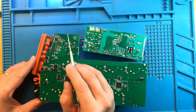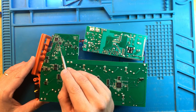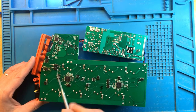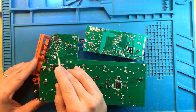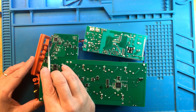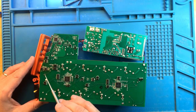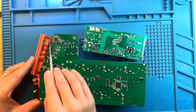My biggest concern right now is that something's wrong with this controller. Because if this controller is fried, we have a problem. Because the smaller LED lights on this unit are powered off of this controller directly. So if this controller is busted, this EB832 is busted as well. However, first I would like to know if there is a 12-volt output coming off of the Aquabus port, because if it does not, then hopefully the problem is somewhere higher than the controller, hopefully in the 12-volt circuit. So let's plug in our multimeter to this 12-volt Aquabus output and see what we get.